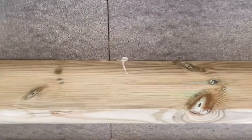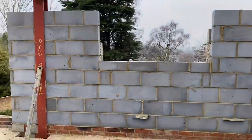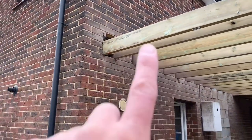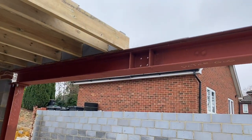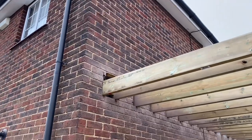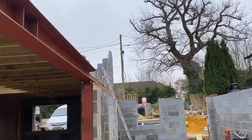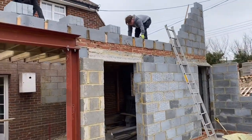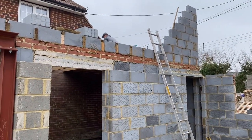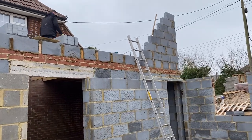And then that's that polyurethane glue — you put it on, should stop it from squeaking when it goes off and everyone's moved in. Then finish getting the rest of the flooring in, and then we're going to break out here because there's a steel going in there, which is that one on the top there. So that's going to go in there, and that supports the brickwork and block work that gets returned here to form the double storey extension. And then that's the end of the joists — I should probably paint a bit of bitumen on them because they'll be in the cavity, just in case there's any damp that gets in. Paint some black bitumen, blackjack or something, and then there we go.